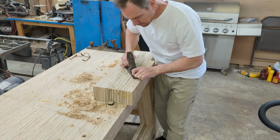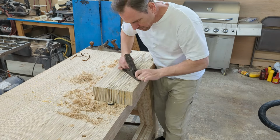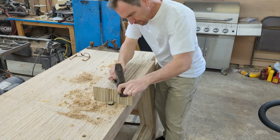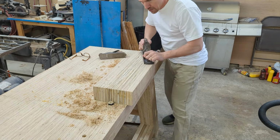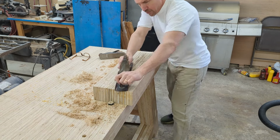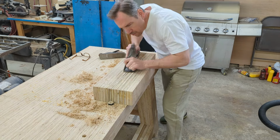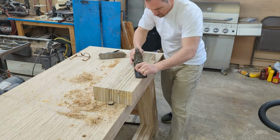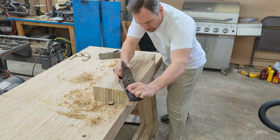Now that the vise base is complete and extremely solid, I can start to work on the vise jaw itself. It is 9 1/4 wide and 27 inches tall. 2 layers on either side are shorter and will be cut away to lose some weight. I also added a couple of inches in height to the vise jaw to be later trimmed off and planed for an exact fit.